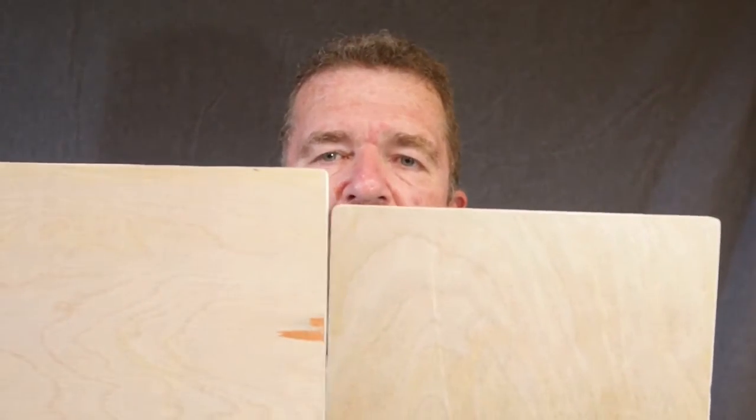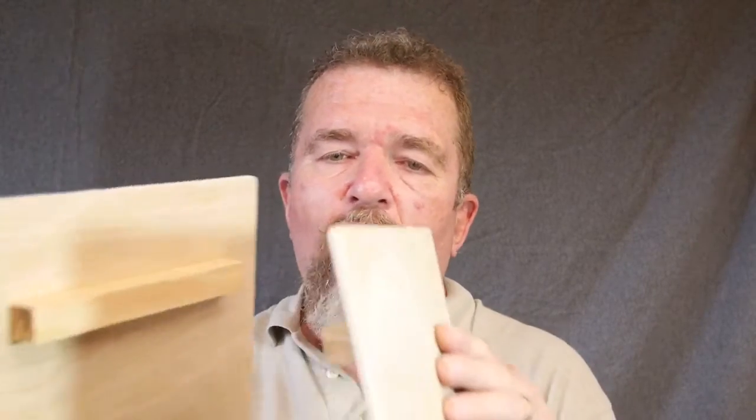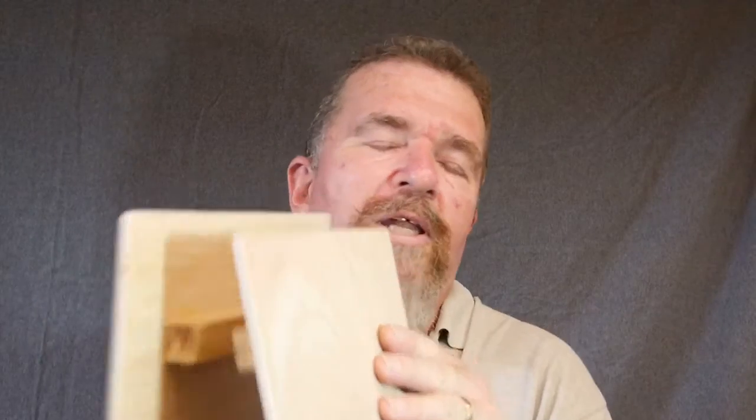Then you're going to flip it over, put your straight edge on the wood on the other side of it, get it lined up, and then you're going to do the same thing to the other side. And then when you're done with that, you simply break it in half, and you'll have a nice little cut here where the edges on the outer laminations aren't going to be flaking off. All you have to do is sand the middle down. That's the best way to work with this thin model aircraft plywood I found from the years of experience making pinhole cameras.